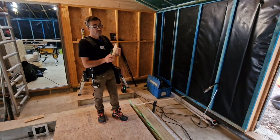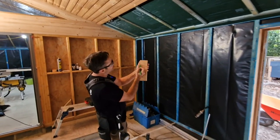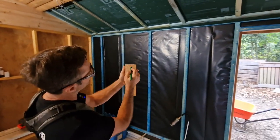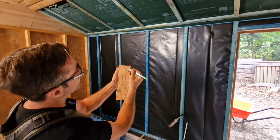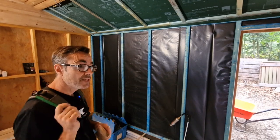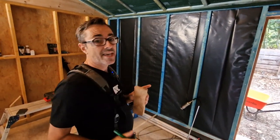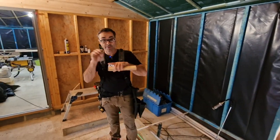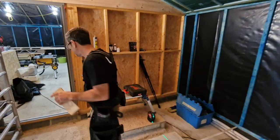And then once we've got that, so we'll have a stud with an angle on the top, we can then establish how high we want to make our wall. We're going to make our wall square on the top, then we're going to make a tilting fillet which will fix everything through. Okay, so we're going to get in there and do that. So I've got the stud, we'll go and cut one, whack it in and try it, and then from that we'll make the overall wall. Make it flat, stand it up, done.